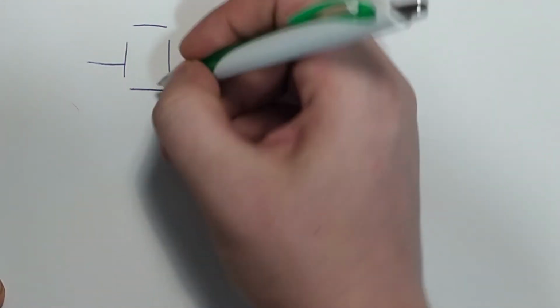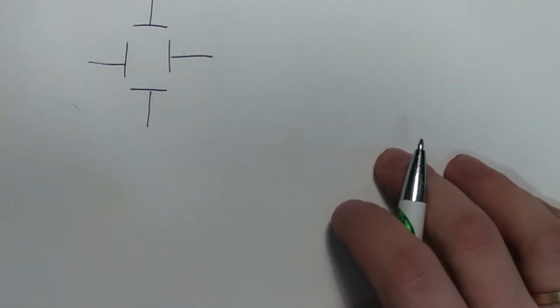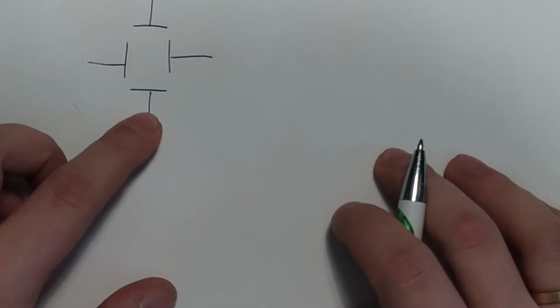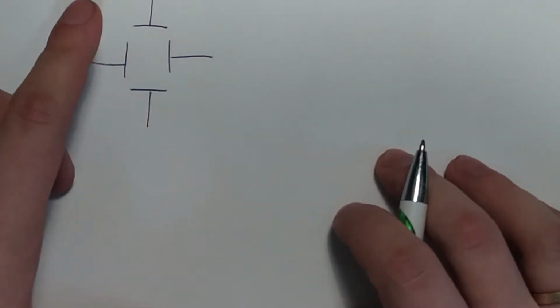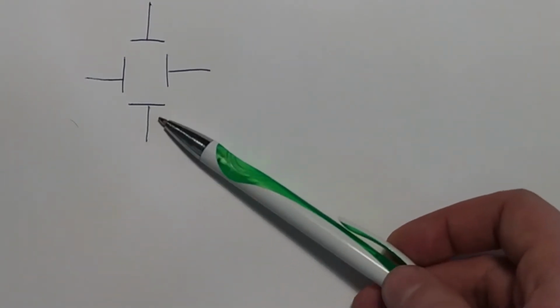The next thing we need to do is drive the deflection plates in the tube. These are vertical and horizontal, and in this tube the vertical ones are further towards the screen than the horizontal ones. That means that we need a little more voltage on the vertical plates because they're closer to the screen, so we need to put more force in to get the same deflection angle.